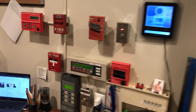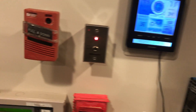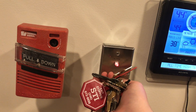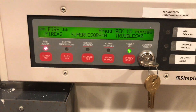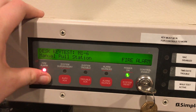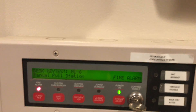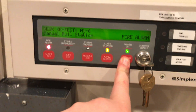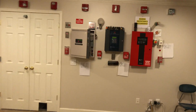Okay, we can do the key test here. We got a silence requested from the annunciator, and then we'll go ahead and issue a system reset — that's been requested from the annunciator — and we'll wait for the panel to go.